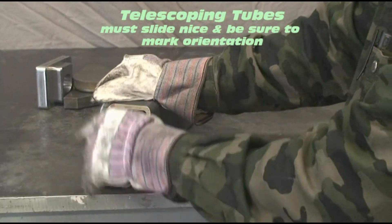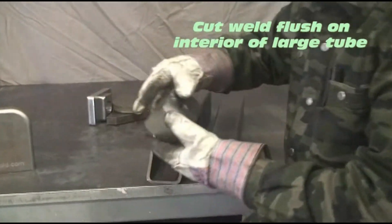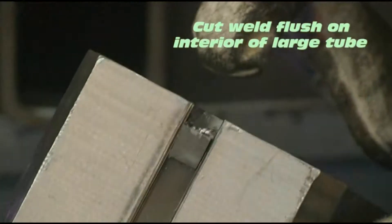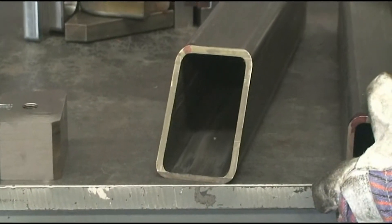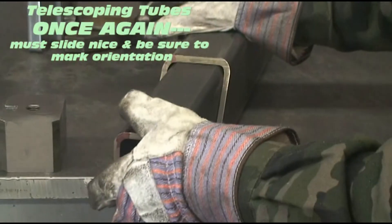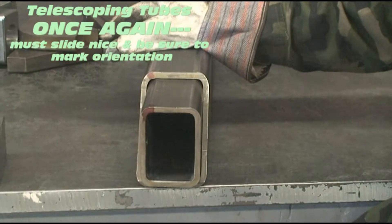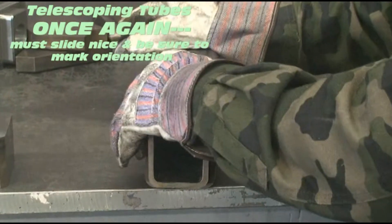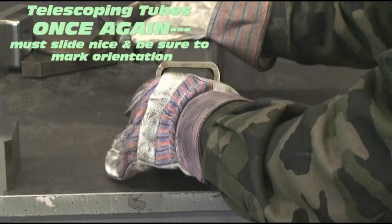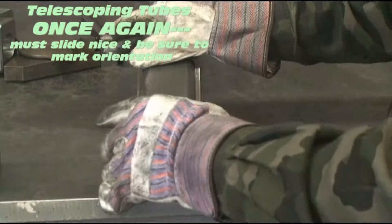In order to get this to work like this, you're probably going to have to cut this weld out of the larger tube. To do this, I used a piece of cold roll with a cutter put into it and a tapped hole to pull it through with a piece of 5/8-11 rod. It is very, very important — I cannot emphasize this too much — that you have to make these two tubes fit together nicely to begin with. If they don't work well now, they never will. You cannot improve things, you can only make it worse. As you weld, you will undoubtedly pull things around and make things worse. So first, buy just these two tubes and try to fit them up nicely like these two do.